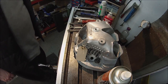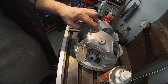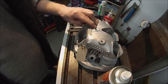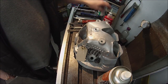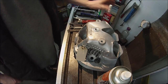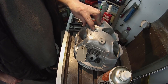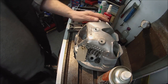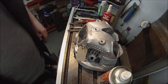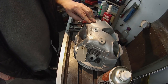There we have it, and that's nice and flush with the head. That massively oversized thread is repaired now. We could have done this with steel, stainless steel, phosphor bronze - whatever you wanted to use. I chose to use dural - it's dural bar in this instance. Just remember, we did originally just have a thread into aluminium, so once that's gone off that should be fine. It's not a particularly ugly repair either. I'm going to have a clear-up on the bench and we'll have a look at the next jobs.